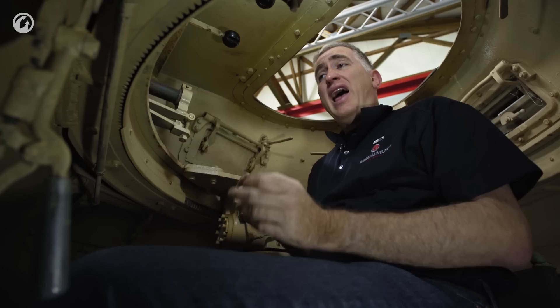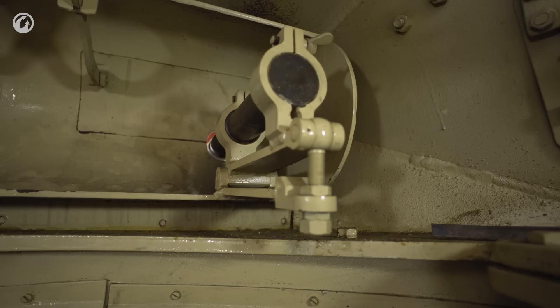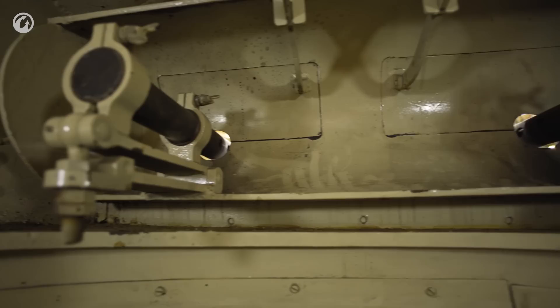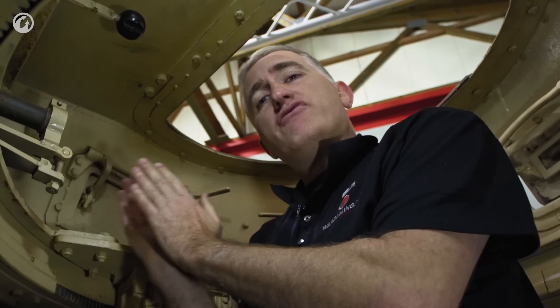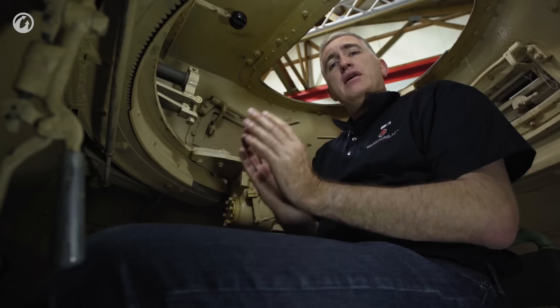You could also disengage the elevation on the machine guns and thus fire totally free-handed. The machine guns were mounted slightly differently on the production vehicles: the left machine gun was mounted directly to the mantlet with no adjustments possible, while the right mounting could be adjusted in elevation and azimuth to allow some sort of synchronization.